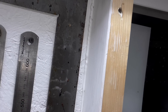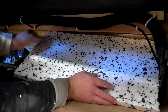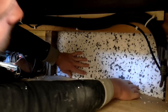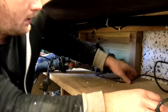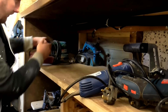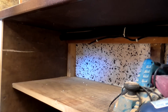I added some decorator's caulk just to hide any gaps. A lot of people commented on my mitre station videos asking why I didn't insulate the walls behind it. The main reason is that adding insulation and plasterboard would lose about 10 centimetres of depth in an area where I really need all the space I can get. There were a few areas where I didn't need the extra space, such as behind the shelf where I store my power tools, so I added insulation where I felt I could without compromising space too much.